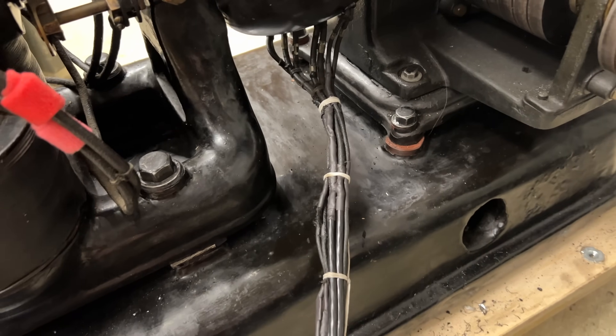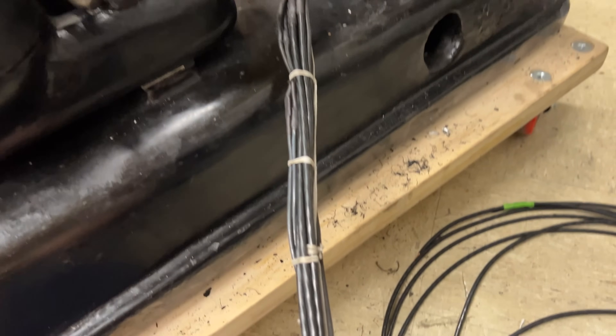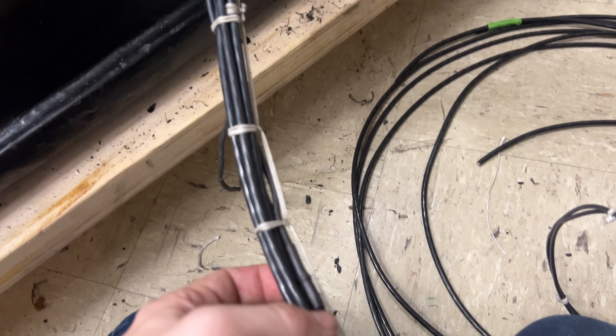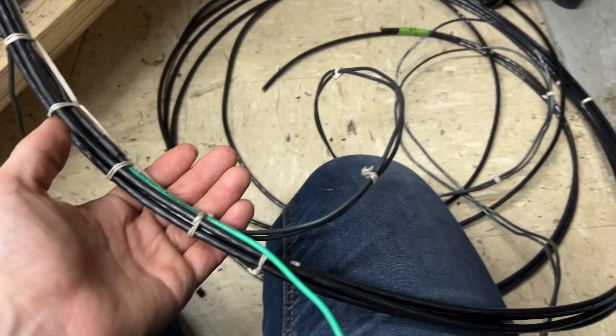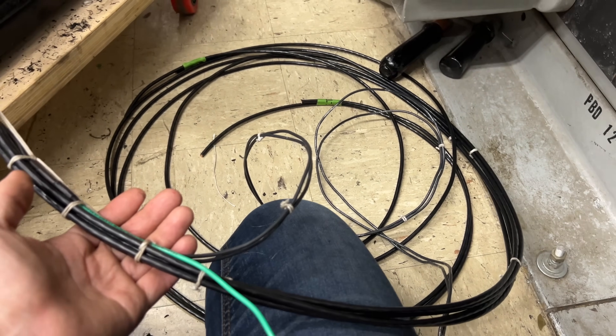While the machine was still on the floor, I found some appropriate gauge wire and began splicing onto the cut leads from the tone alternator. I left each wire long enough to reach its termination point at the top of the 803C board, so that once everything was in place, it should be pretty straightforward to lay them down where they need to be.